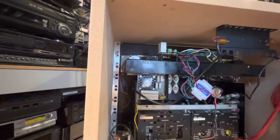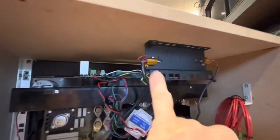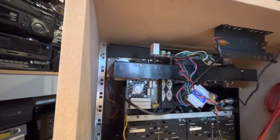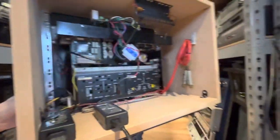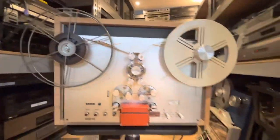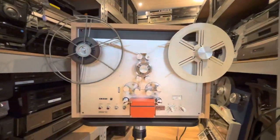We also had to make some modifications to the take-up and feed reels, which were tripping because they were drawing too much current — they were trying to pull the film too fast and causing too much damage. So I put a couple of fat resistors on a heat sink, one on each side, to reduce the torque on the motors. The end result is we are now able to play back sound from either the edge track of a magnetic film or from a full-track recording and digitize that separately.